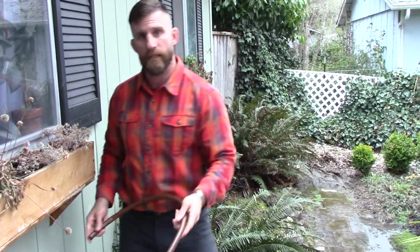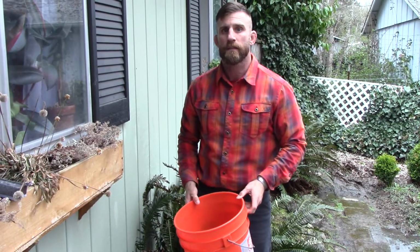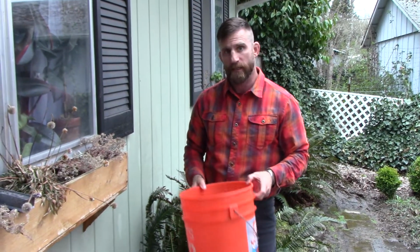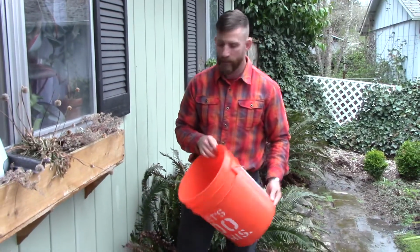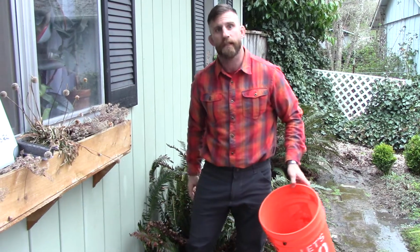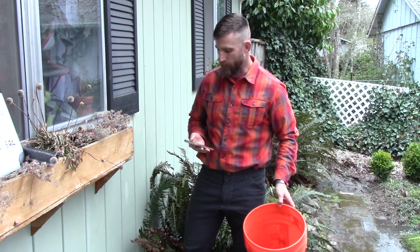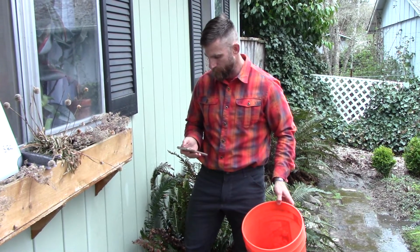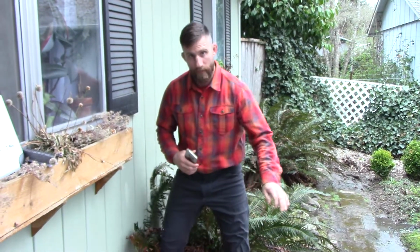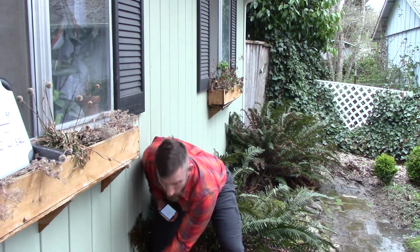Okay? So the next thing we're going to talk about is the gallons per minute. We should know how much water is coming out of our house as well. So to do this, we're going to do a bucket test. I'm going to turn the faucet on full speed. I'm going to take the 5-gallon bucket. I'm going to put it underneath the faucet, and I'm going to time how long it takes to fill up the bucket with water. Okay? So I'll get my timer ready. I'm going to turn the faucet on, put the bucket in, start the timer, and time it. So, here we go.